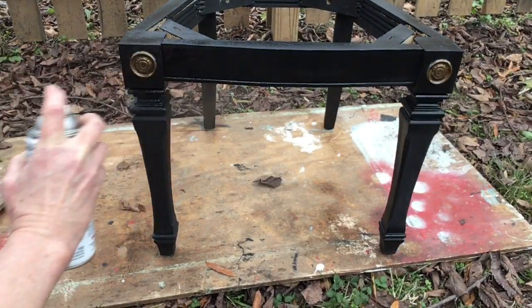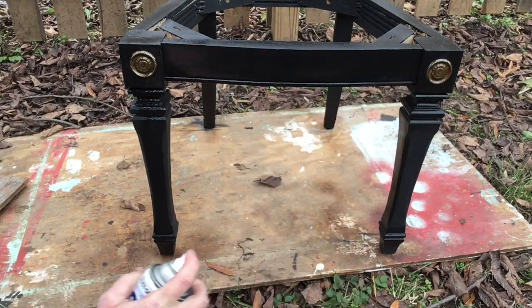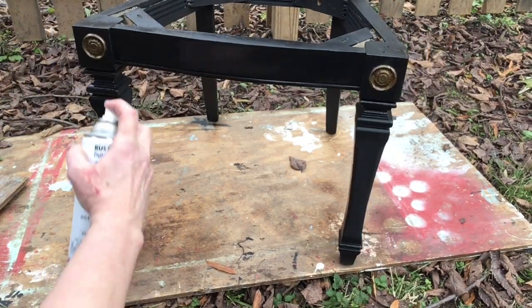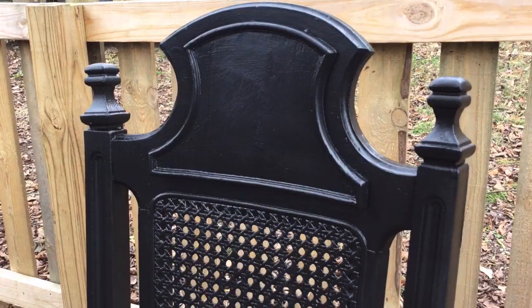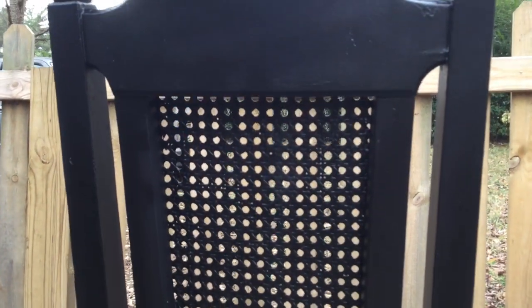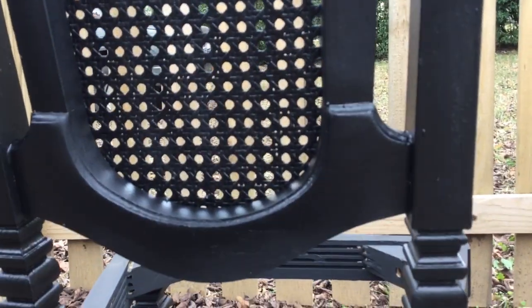This is a perfect example of what I mean about spraying left to right and then up and down. I've got places on these legs that some need to be painted side to side and some need to go up and down. So I just do the side to side pieces first and then go up and down and try to stay as light on the up and down as possible. If by chance you get a drip in your spray, wait until it dries and then gently sand it and repaint it. Normally, furniture needs 3 light coats of this spray to seal it.